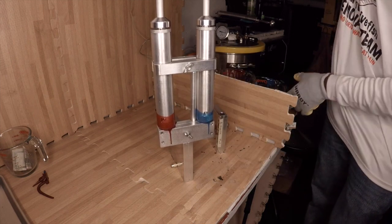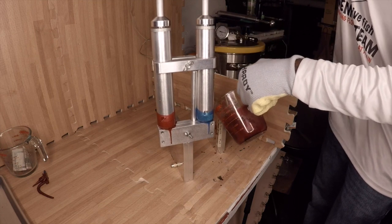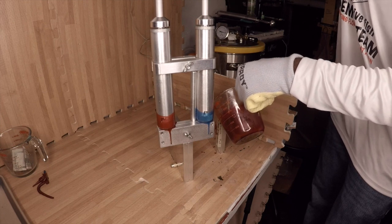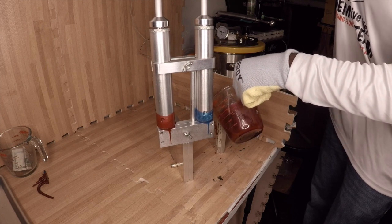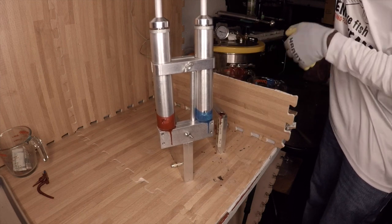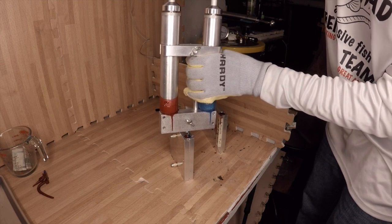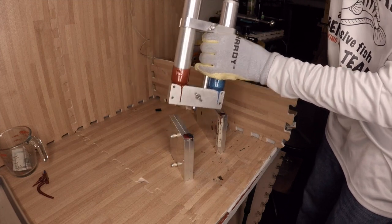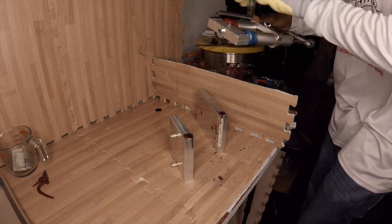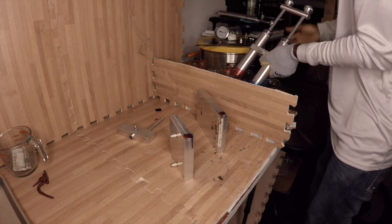Hold that, and while we're doing that, I'm going to go ahead and fill up the sprue from this, because it is sucking up a lot of plastic. And I don't want any dents in them. Alright, so I topped this one off, and it was because I didn't top off the sprue opening when I first did it, because I wanted to go ahead and do the crawls.